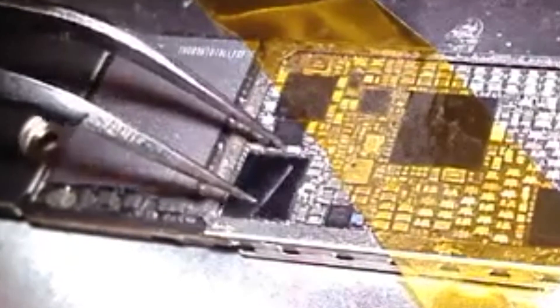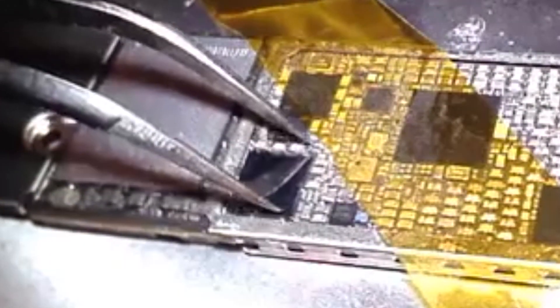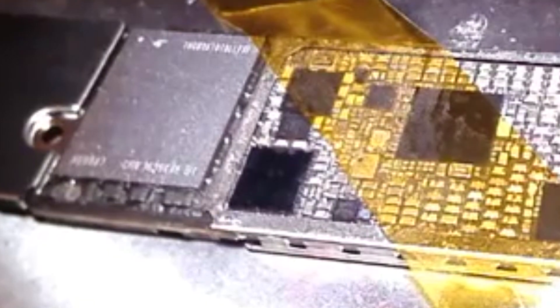So we're going to place this chip as best we can. It doesn't have to be perfect, but you do want to make sure that it's what we call a high spot — and that means that the balls on the chip are directly on top of the balls on the board. What that's going to do is raise that chip up a little bit higher than anywhere else. If you find that that chip is sitting at a low spot, you probably don't have it aligned with the balls. So now we're going to wait for this hot air gun to heat back up to about 350 degrees — that's usually what we're doing all of our large chip replacements at. Smaller, minor chips happen at about 278 to 280 degrees.